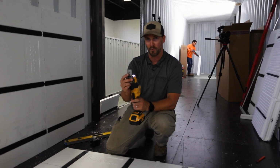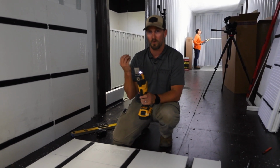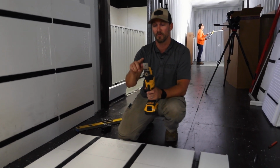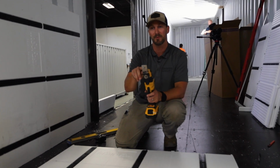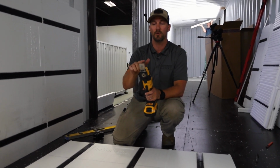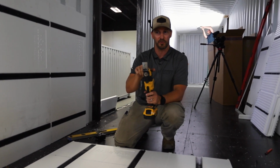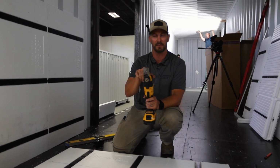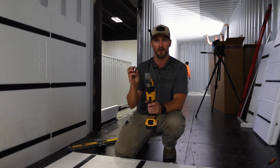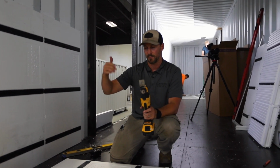That's the most important thing to consider when you're cutting through pretty much any of this foam. You don't want a very aggressive tooth on any of the saws, whether you're using a circular saw to cut the panels, a table saw, a Sawzall, anything. You want to have either a metal tip or a fine finish carpentry tip. And really how you're going to be able to tell instantly is a ton of little tiny teeth, not the very aggressive tooth, because it's going to grab that foam and it's going to be vibrating these panels.